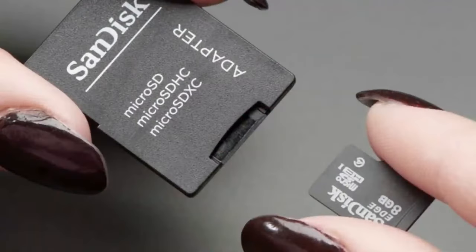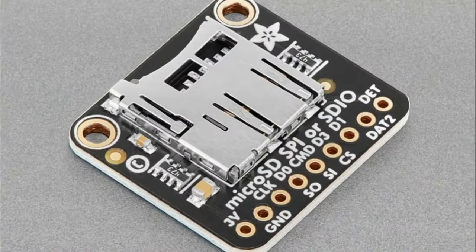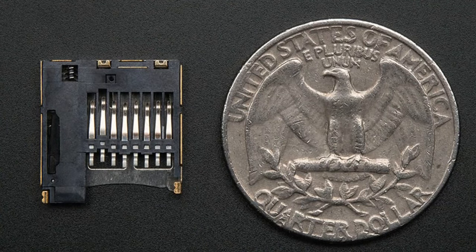Micro SD cards. They're amazing. They're so inexpensive. You can get them in any size from like 64 megabytes up to like half a terabyte. Basically, you can buy them in grocery stores or, of course, DigiKey has hundreds of different varieties in stock, sizes, prices, capacities. But 99% of the time when people are using a micro SD card or micro SD card socket, you're going to use an SMT right angle socket like this. I linked to it in the text for this NPI, the DigiKey part number. It's got the pads and pins on the bottom. They're very secure. This is a push-push type because you can see the spring. And they're inexpensive and very easy to use, but you need to mount them in a way so that the PCB is right up against the edge of your enclosure so that the microSD can pop out. And that isn't always possible depending on your mechanical design.